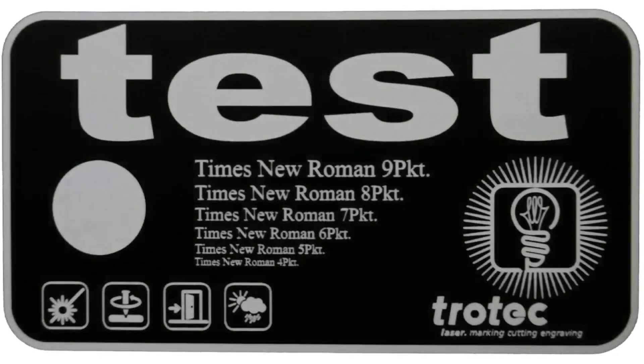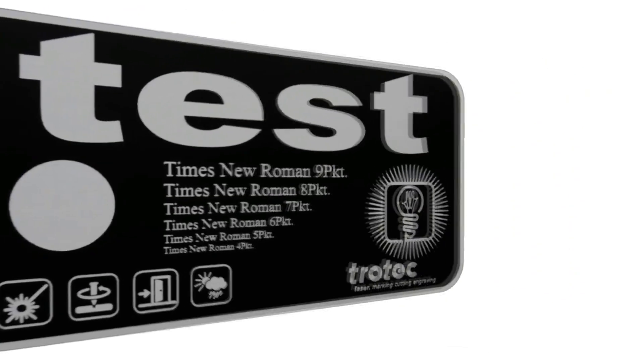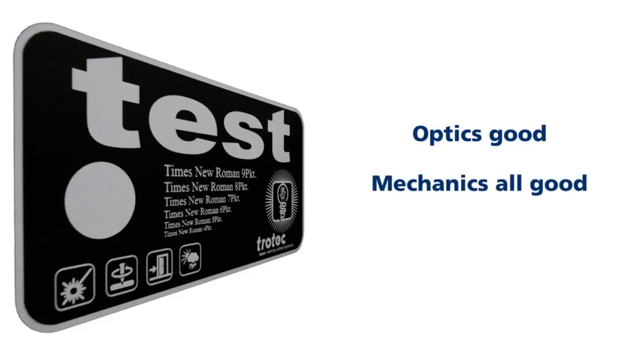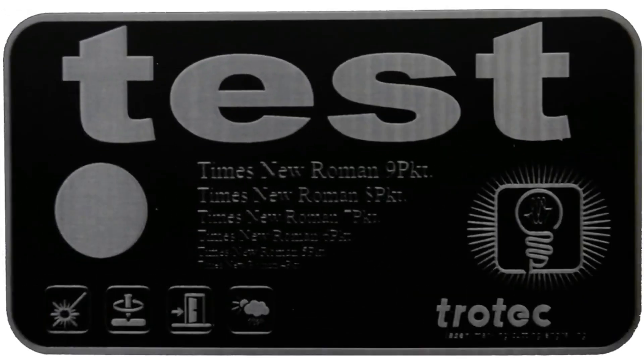So the conclusion for the two and a half inch lens is that you should be able to engrave good quality 6 or even 5 point text on anodized aluminum using the standard settings. This is of course with the assumption that the optics and mechanics are all okay and that the machine is properly calibrated. If the material is outside the depth of focus, we can see a clear drop in quality with a loss of power or intensity and detail.